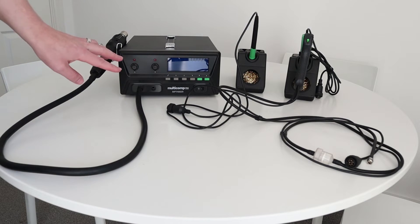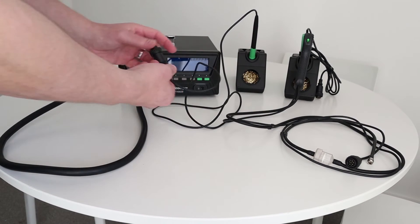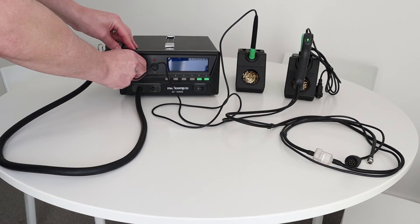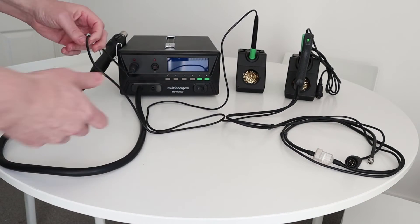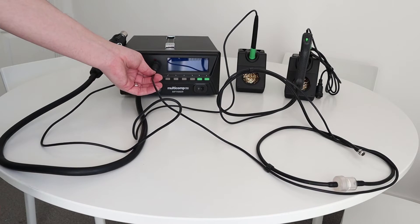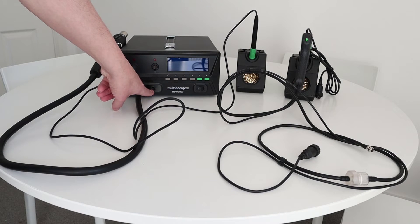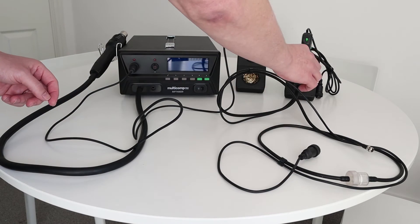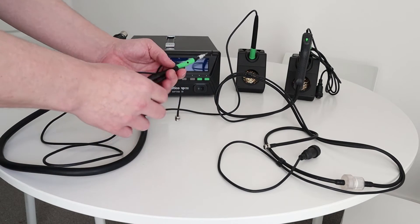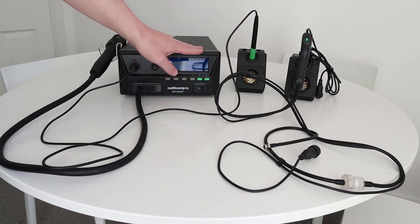Operation-wise, the heat gun is always connected. You have two ports, so you can connect either the soldering iron or another device using a simple push-fit and then give the locking nut a twist to secure it. Similarly, the desoldering gun pops in and you give it a twist. The important thing to remember is there's only one suction pump, so you can only use the desoldering gun or the pickup tool independently — not at the same time.